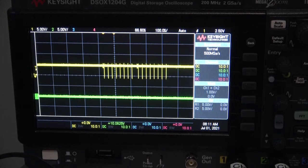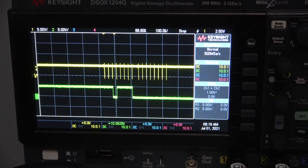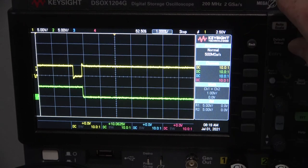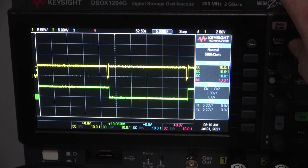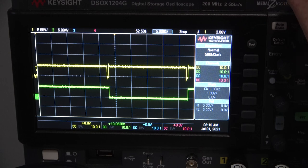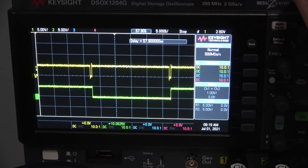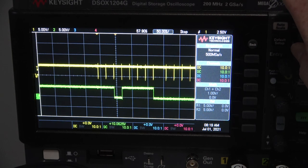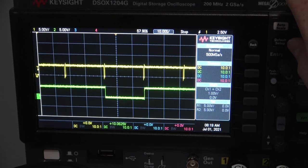Start's not working, though. Kind of wondering if maybe the Nintendo isn't responding because the pulses aren't where it expects it to be. Well, why does that make a difference? I mean, it was working, like the main menu of the Retro USB was working, but of course that is an FPGA. It runs infinitesimally faster than the Nintendo. What if I change the spy mode, if I can get these to line up better?